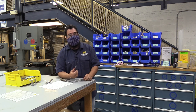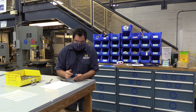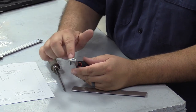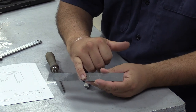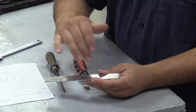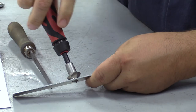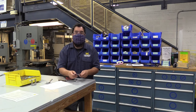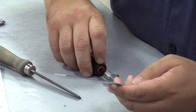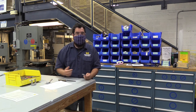Then I have my deburring tool. This is one type of deburring tool — Wilson Center has three of them. One is a swivel, one is a three-sided knife, and this is a round deburring tool. If I look at my round deburring tool here, I can see that I have a cutting face, and as I rotate, it can only cut one direction. So if I'm looking at my hole here, I can see there's this raised metal — that is from when we punched through with the tool. I want to cut that off, so I'm going to push it in, put a little bit of force here, and rotate. As I rotate, I'm actually cutting the metal — see these little chips that came out? You're actually cutting a chamfer into the metal. Sometimes you want to do both sides. You do want to be careful not to make the hole bigger than you intend it because you're cutting. We're going to check all the holes and chop all the edges, so make sure you do it appropriately. If I do it after I bend it, it's really hard to do the whole thing.